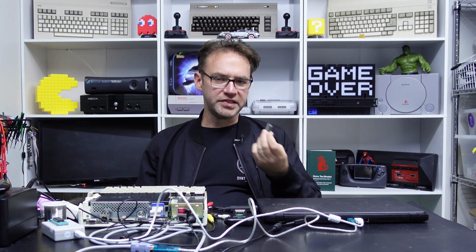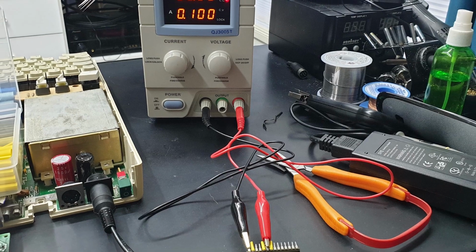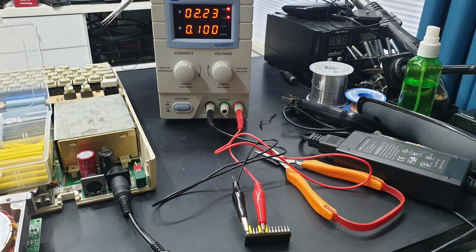The other thing I forgot to mention in the last video is to do with the integrated WOZ machine, the disk controller chip. Now, this is the one from the other machine, which wasn't functional. And what I actually did was hook up a 5-volt supply between the ground pin and the read-write pin, just to see if I could blow through that short. I mean, this chip was destined for the bin anyway, so it was worth a shot, and it did almost work. Now, I say almost because signals were actually going through that pin.